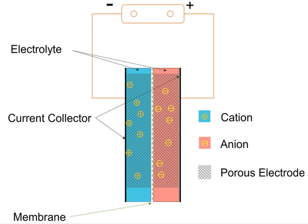Lifetimes are also dependent on the operating voltage, because the development of gas in the liquid electrolyte depends on the voltage. The lower the voltage, the smaller the gas development and the longer the lifetime. No general formula relates voltage to lifetime. The voltage-dependent curves shown in the picture are an empirical result from one manufacturer. Life expectancy for power applications may also be limited by current load or number of cycles. This limitation has to be specified by the relevant manufacturer and is strongly type-dependent.